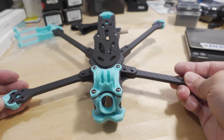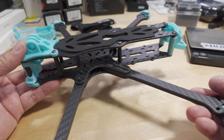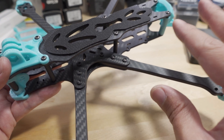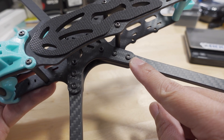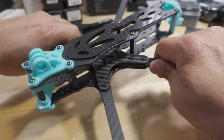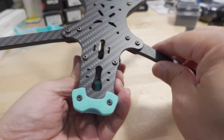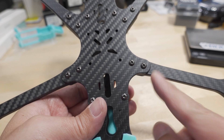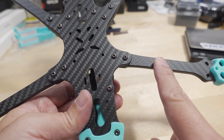Here's the frame completely assembled — it was very straightforward, nothing really unusual about this frame build. A couple things to note on these press-fit nuts: all the tolerances on the screws and the holes in the carbon fiber are very tight — not too small, but just right, so that you have to screw the screw into the carbon a little bit. Everything makes the whole frame come together super solid. There's no play in any of the arms whatsoever. But it does mean that you have to be kind of deliberate about how you put all the screws in. For the arms, there are only two screws and two press-fit nuts on one side holding the arm in.